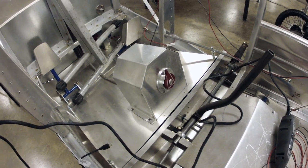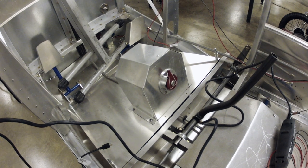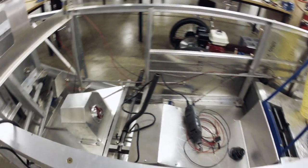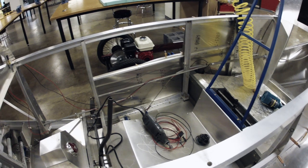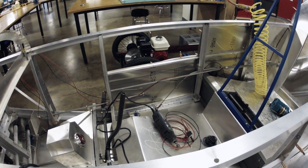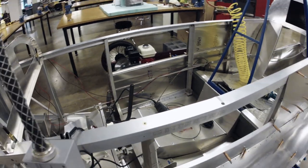One configuration has 90 degree fittings on the back that would take up a little less space. We're going to see how this works - I think there should still be plenty of room. I can use that housing to house a switch or indicator lights, so it's not going to be wasted. I don't think it's going to be an issue. But we'll see when I'm able to sit in there for the first time, which you really can't do until you've got the sides riveted in. The strength is not in the fuselage yet - if I sat in there, I'd start popping Clecos and bending things.